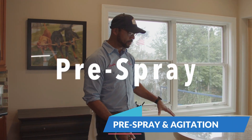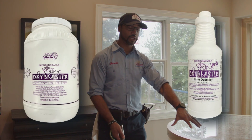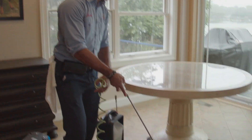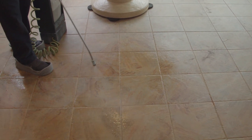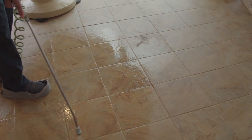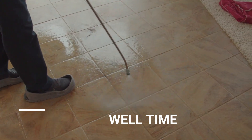So now we're going to start, after we've prepped the areas, by pre-spraying. We use GreenPak to pre-spray all the areas. You always want to make sure that when you're pre-spraying, you don't spray too little, but also you don't spray too much. You want to make sure that this is going to stay wet for at least five to ten minutes. That dwell time is going to help loosen up any deep embedded soil.